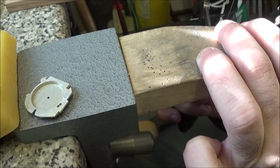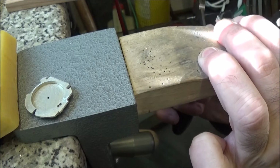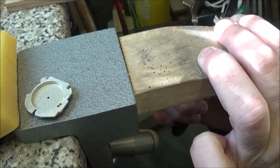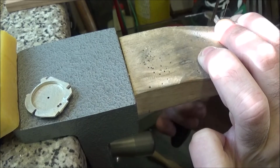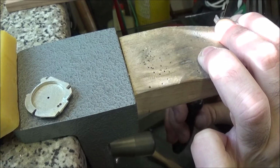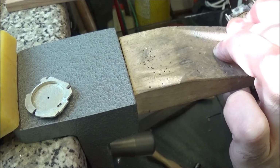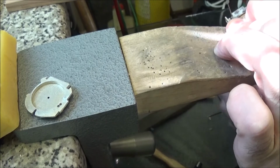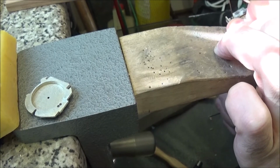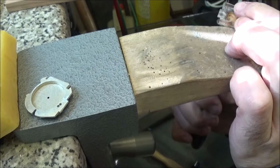So I'm going to work on the lugs using hard solder, and then when I attach the lugs to this piece, I'll just use easy solder so as not to disturb anything. But I had multiple attempts at soldering certain pieces which didn't really go well because it needed cleaning up, which is why I ended up boiling the kettle and putting it in the acid.